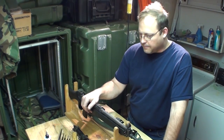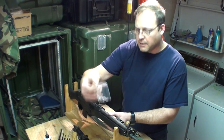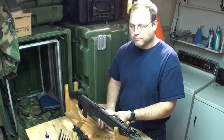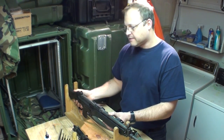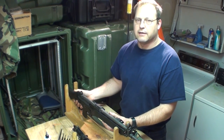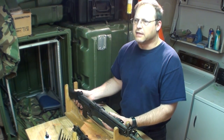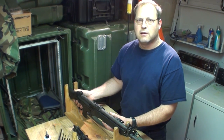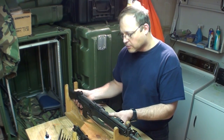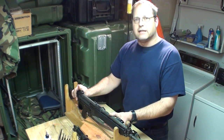Since then I'm not sure if that gap has gotten smaller, so I'm going to measure it. I bought some brand new HK rollers — I'm going to install those. These are Plus 4 rollers, so those are two sizes larger than the stock ones. I did measure the rollers that were in here and they are the standard size, so the Plus 4 should give me somewhere around 4-thousandths more gap. We'll see how that goes. I'll show you how I install the rollers, which is really not that difficult a job at all.